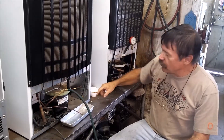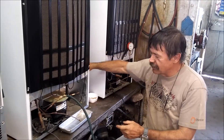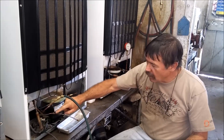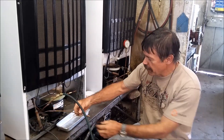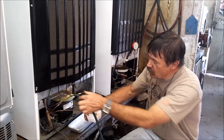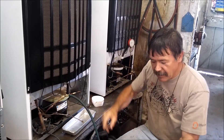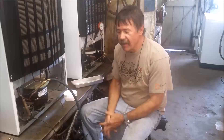What we do is we put some thinners — normal thinners — into the system, which actually dissolves it. But you don't want thinners in the compressor as it harms it. So what I do is connect this charge line to a vacuum pump, and we have a little container with thinners and suck a vacuum to draw a little bit of thinners up the capillary tube, then straight away blow it out with the 404 gas.